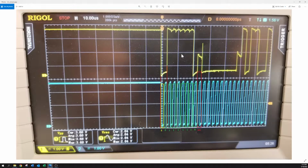And so the spec says that it needs to be lower than 30% of VCC, which is about 1 volt. So it needs to be about right there somewhere before the I2C protocol recognizes this as a valid ACK. Without a valid ACK, the master controller, the ESP32 chip, assumes it's a NACK, and NACKs can either retransmit or stop, or there's a couple other conditions that I don't really remember off the top of my head. But anyway, all of them aren't good.